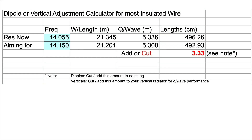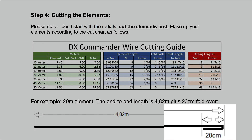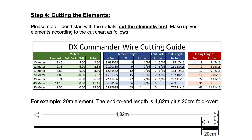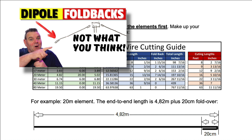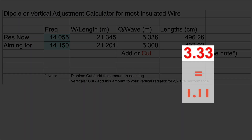When it comes to trimming this thing, you can use the SWR calculator that is on the DX Commander website — I have also linked it in the description. If you do it this way, there's something you need to keep in mind, and this goes against everything I've ever learned about tuning wire antennas: when you fold an insulated wire back on itself, it doesn't shorten by as much as you would think. Callum did a video on this and I've linked it in the description. In a nutshell, it only shortens by about a third of the amount you fold back. I found this to be the case in my trimming experience.